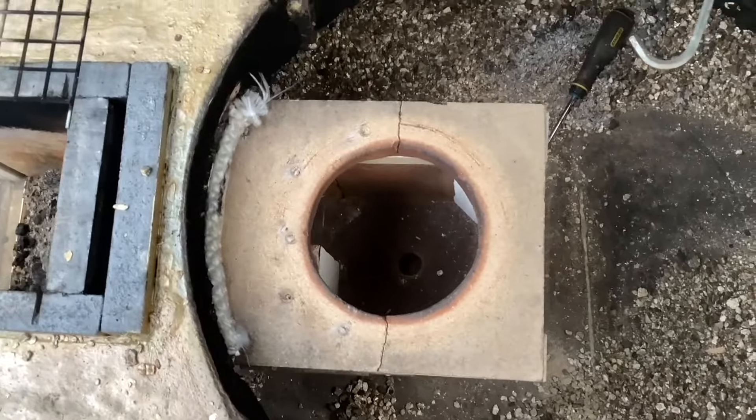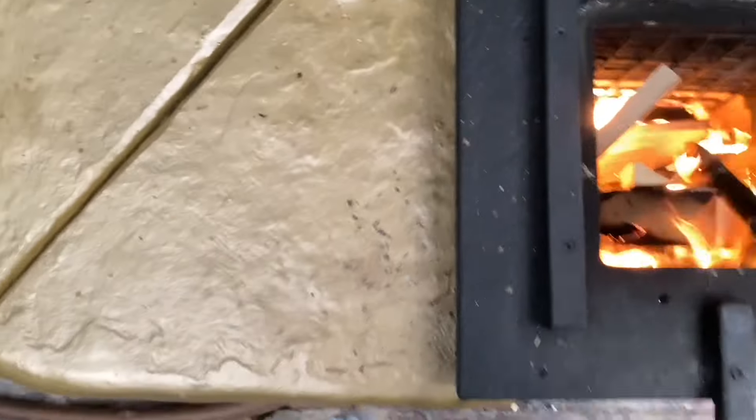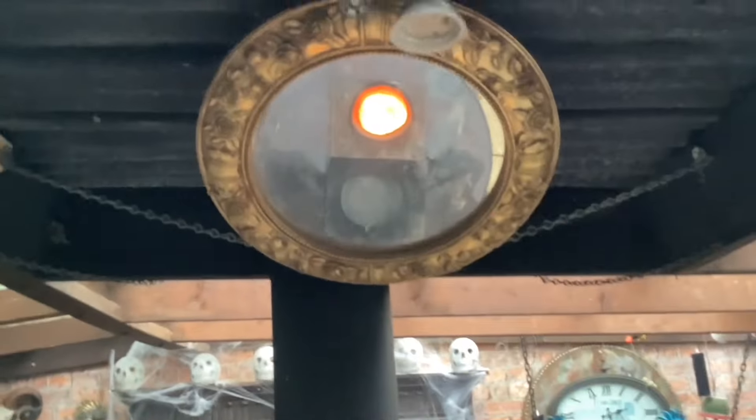You can see an incredible glow. I'll put this stick out — wow, that is just pulling in the smoke like you wouldn't believe, sucking that smoke right in. That proves the secondary air is working. It's quite a big gap, but because it's so hot in there I thought the air would be expanding a lot and I needed to leave a big gap.